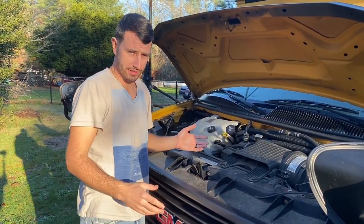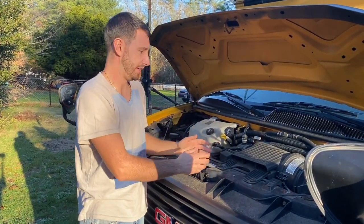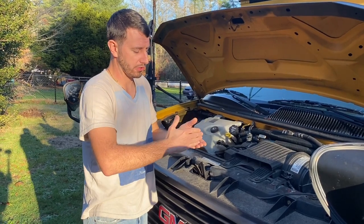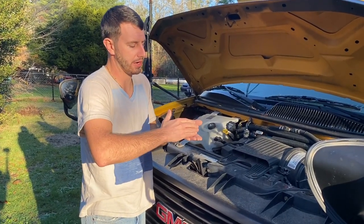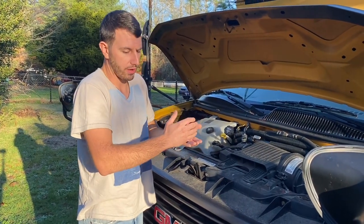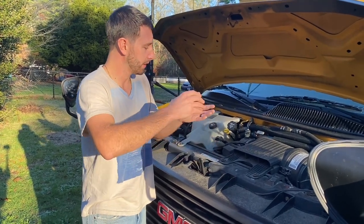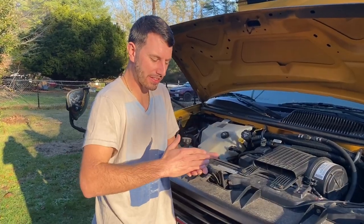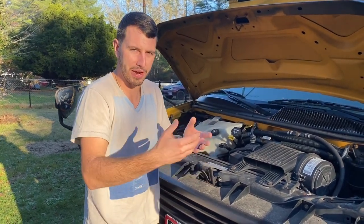So the battery died in this, and we jump it now, and every time you let off the gas, it just dies. What it's doing is, as the throttle blade is closing, there's some junk built up around it, and it has to relearn where the idle is. The option is to have a good battery, which we don't have, and it'll relearn eventually, and it'll know where to park itself, or clean all the gunk out so that the throttle blade can close to where the factory setting is, and a little bit of air will still get by like it's supposed to.